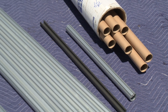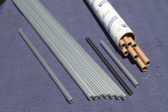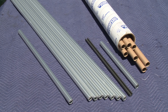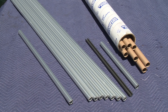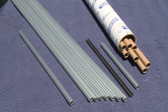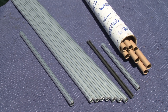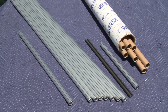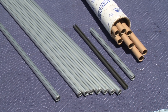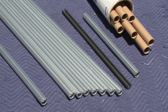Inside the shipping tube are the longer joints and extrusions required to assemble the system. The shorter extrusion is the half extrusion, used to stagger the joints at the top to allow installation of a longer bearing. There are a number of full-length extrusions that are six feet long. The darker extrusion is the bottom reinforcing extrusion joint, used to span between the torque tube and above the feeder into the first extrusion. The bottom short piece is the outer extrusion used between the torque tube and the feeder.